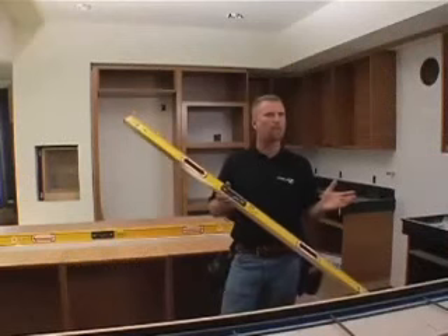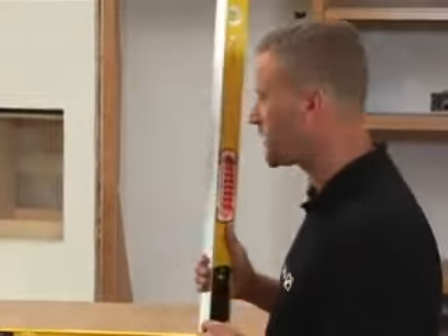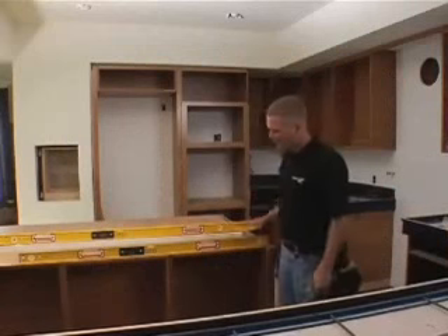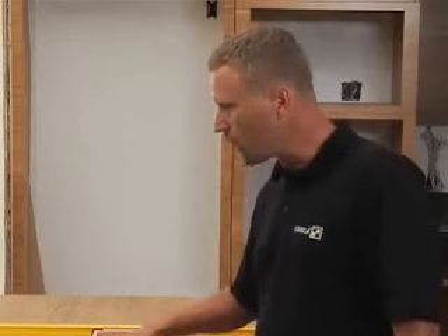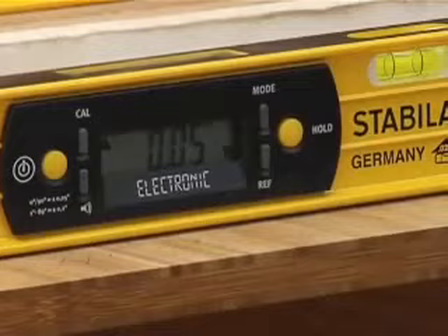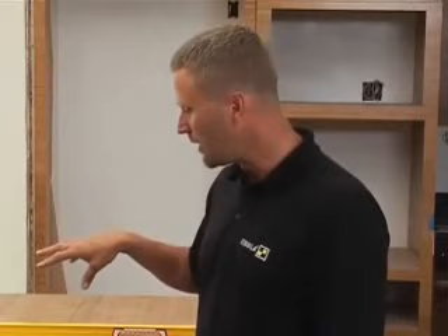The Tech Level also works great on interior job sites. We're in a residential job site with high-end cabinets and countertops. As I put the level down on this cabinet island, you can see another reason why we make longer levels beyond just a 2-foot and 4-foot. Here we have a 59-inch level and a 78-inch level so we can reach from one end to the other — that's the most accurate way of working. Right now the level is saying 0.05 degrees, which means a 32nd of an inch over 6 feet. It's pretty close, but we can shim this cabinet and make it perfect.